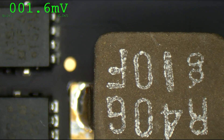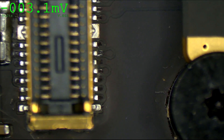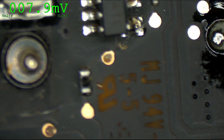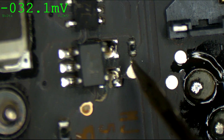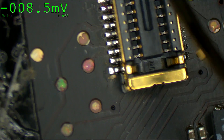We're going to check over the DC inboard connector because this is where the charger talks to the SMC, and also where the 3.42 volts goes over to the DC inboard — and that looks just fine. We're going to look at our DC inboard cable and that also looks just fine. In our DC inboard where our one-wire circuit is, this is what powers the one-wire circuit chip, which is what allows the charger to talk to the SMC. All this looks just fine.